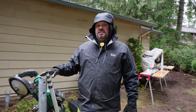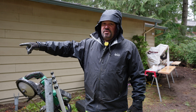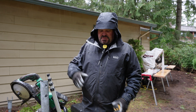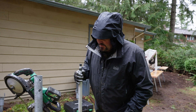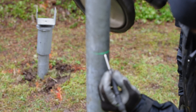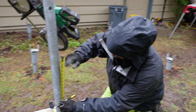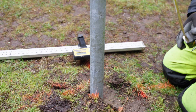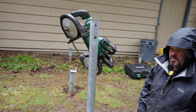Now we can do this two ways. We can either set the laser 18 inches below grade, which would be a little bit difficult - I'd have to put the laser in the dirt to do that. Or what I've done is set the laser up to the exact height I need to the top of the decking, then subtracted those thicknesses and gave myself a half inch of play with the adjustable base. So we need 18 inches below. You can see right here, here's my laser line - I just need to go 18 inches below that, and I know I'll be right on the money as far as height goes. I'll go to that line, go down 18, mark it, and then we're going to use this Metabo HPT cordless bandsaw to cut the post down to the proper height.